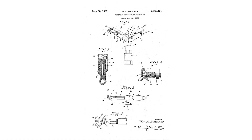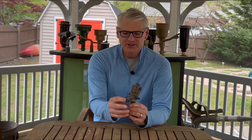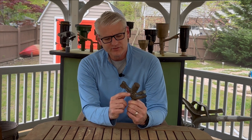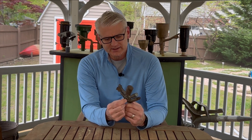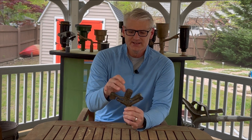It was a patent that William Buckner himself was granted. By 1939 he was about 67 years old, so he was still very much at it. This is the standard dual-action you'd expect — it has a wedge drive and it's also an impact. By the second half of the 1940s, this shock-absorbing plunger goes away, and all you have is the cap on top of the adjustable spring.